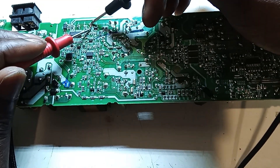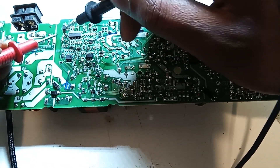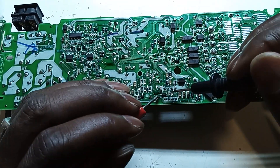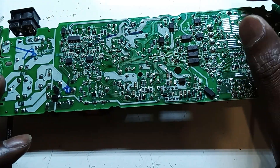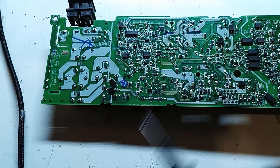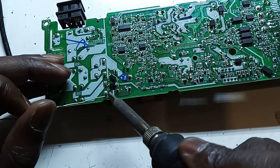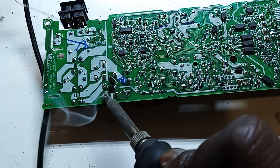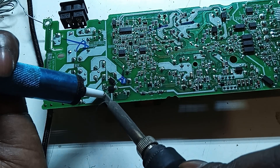Okay, let's look at the diode here. Diode is okay — looks like she'll be fine. This one here also reads on both sides; that's normal on that side. I won't really bother much here because I think everything should be okay. Also the other guy here — okay, that's perfect. So we need to remove this guy here. Let's look at the rectifier — let's just lift at least one leg and see if the short remains on the rectifier. Just to confirm where the short is coming from.